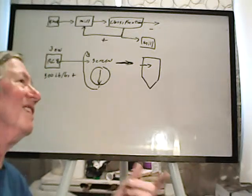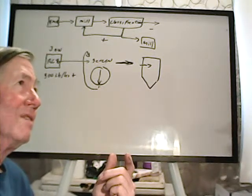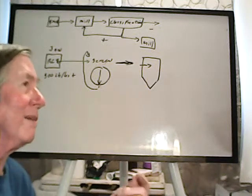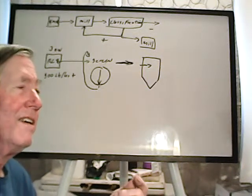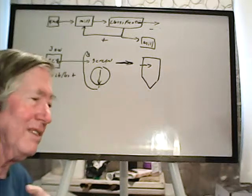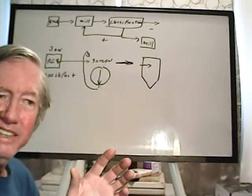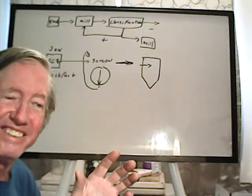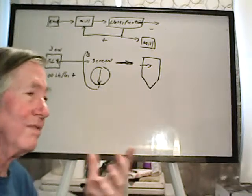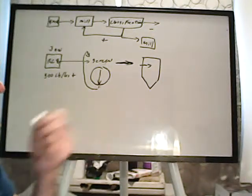Well, right away with my material, it consumes, what was it? Roughly 3 milliliters of concentrated hydrochloric acid per gram of ore just to neutralize it. Right. So your consumption would be outrageous if you were trying to use an acid dissolution. You'd have to use so much acid. Right. It would be extraordinarily expensive. And a nightmare. Not only expensive, but the fumes would be horrendous. When you're dealing with small quantities, you can have a little fume hood or whatever. Right. When you got a couple of tons of stuff, right.